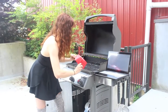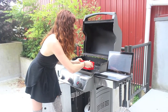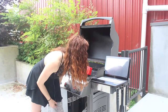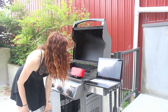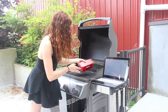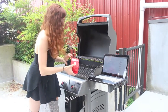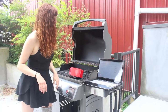It's buzzing! That's a good sign because that means one of the readings was over threshold, which I would expect because I opened the propane tank — you shouldn't get that high of a reading in normal day-to-day life. It looks like my internet is being kind of finicky, so not every value is printing. But that's what's nice about having the buzzer. It's the natural gas one that's going off. Interesting! So even though I'm not getting values because we're a little too far from my Wi-Fi, it'll still tell you if something's dangerous.